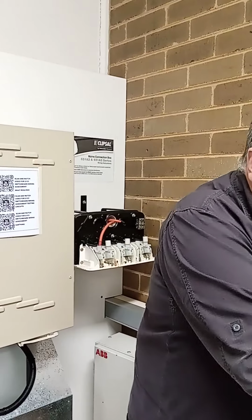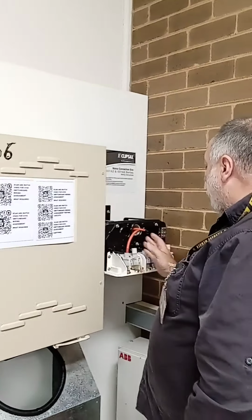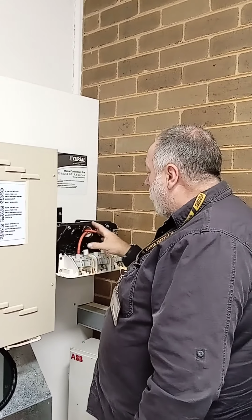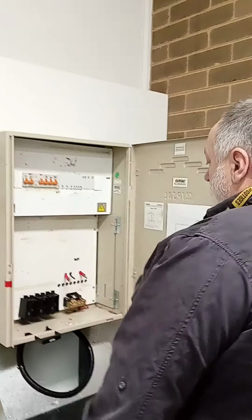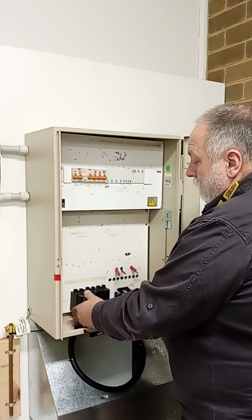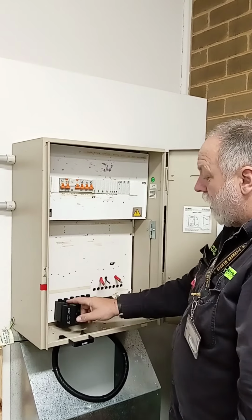Okay, we have our fuse wedges here, which we're using here. So normally on this you'd have a single phase here with the neutral on the end, but we have a three phase, doesn't matter, same thing. So we've got our point of attachment. We come into our switchboard. We have the first fuse. So if we had a single phase switchboard, these wouldn't be in here. We'd still have our neutral and our service fuse.